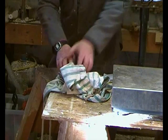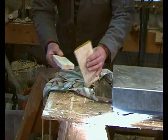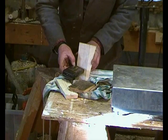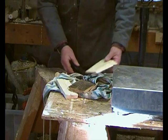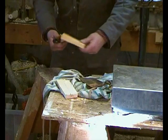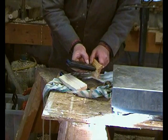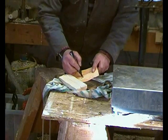So even marginally — can you see they all look the same now? That's the birch. The birch on the moisture meter, press that button, is coming out at 60%. This is the gnarly old bit of Scots pine. Probes right in there and that's coming out at about 70% — I'll mark that SP.